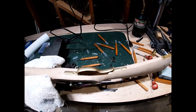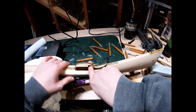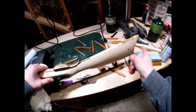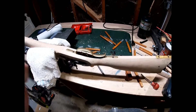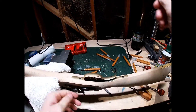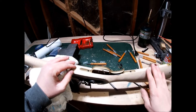So if my angles are weird, I'm wearing the camera on my chest instead of on my face. We're gonna let that wood glue dry so we can finish setting the trigger in there, shave off some of this meat up here, drill the pre-holes for the screws, and set the screws into this trigger guard, then finish shaping up the back of this butt plate. All right guys, wood glue's dried, we've got the trigger set in there, everything is engaging with the hammer, the triggers are good, we've got the trigger guard inlet where it needs to be, everything is pre-drilled and screwed in.